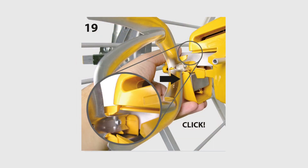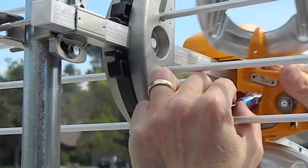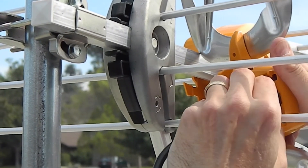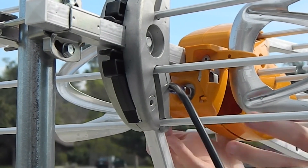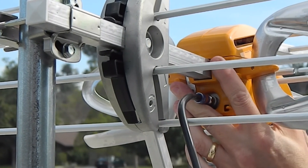The final thing they don't tell you is that you really need to make sure you attach the RG6 connector before you snap in the cartridge, because it's almost impossible to do after you've snapped it all into place. Put it on nice and tight, then slot it in right on the aluminum — once it's slotted in properly, it should slide into place and click.